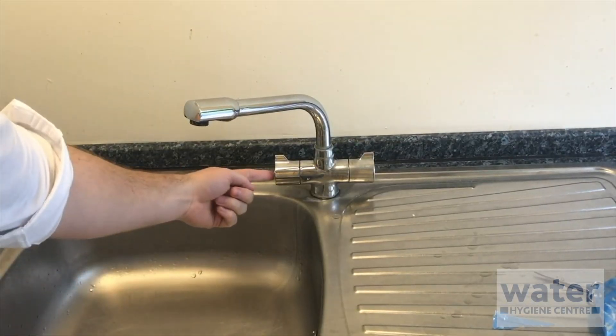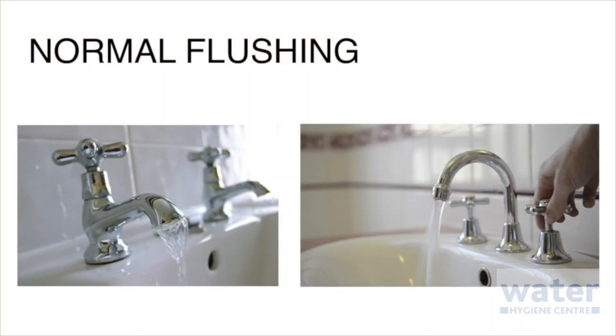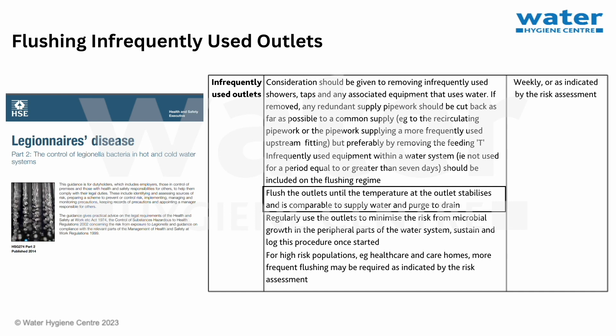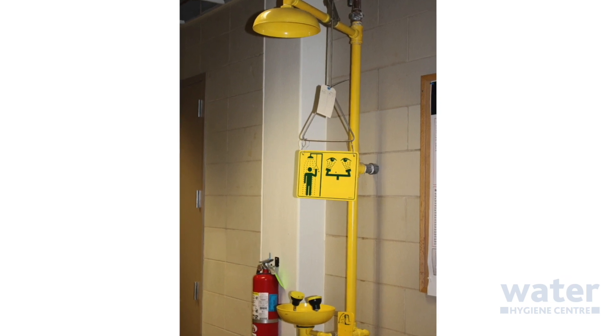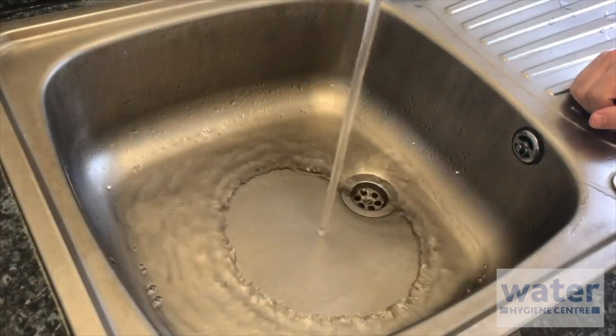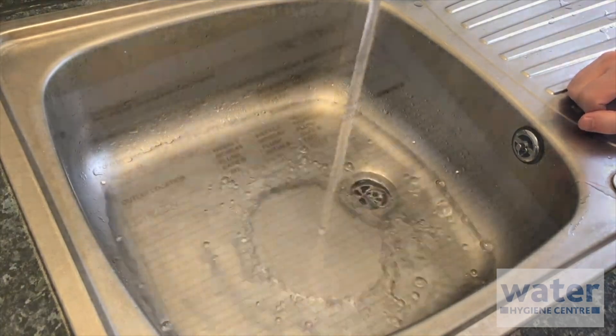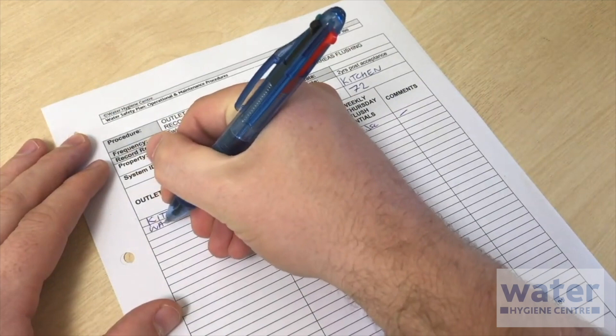Make sure you flush both the hot and the cold supplies. Once you've completed your first safe purge, you can then continue to flush normally. The flushing time itself should be long enough to ensure that all the water for that outlet has been drained and the supply pipe has been charged with fresh water. You should flush the outlet until the temperature stabilises and is comparable to the supply water and purge to drain. The same principle can be applied to any of the outlets mentioned — showers, outside taps, sinks or baths. Whichever method you use, you must ensure that the water is not being aerosolised. When you have completed the flushing, record this on your flushing sheet.